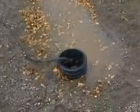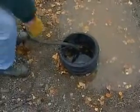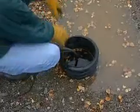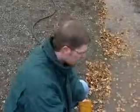We're going to go ahead and make the connection. By doing this, the pump is now turned on — there's no switch. We should be pumping out. To verify that we're actually extracting water, we'll go down to the end of the hose and see how much volume we're pumping out. If there's nothing coming out, we'll have to make sure that the screen on the bottom of the sump is clear and free of debris.